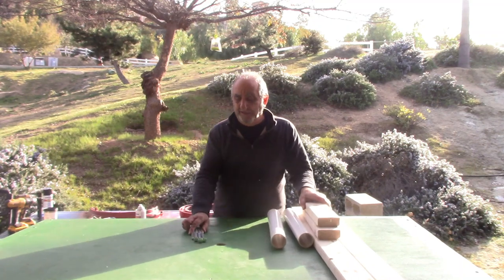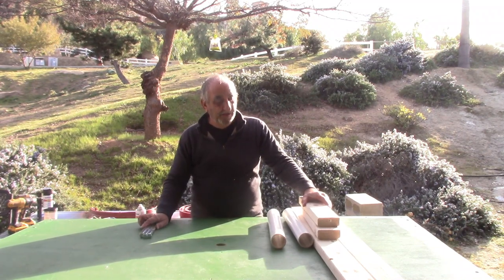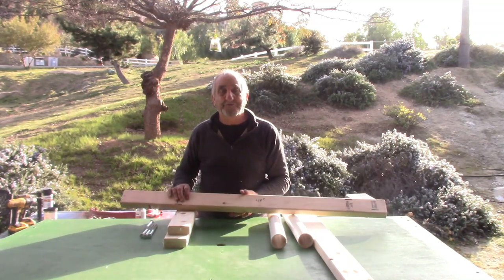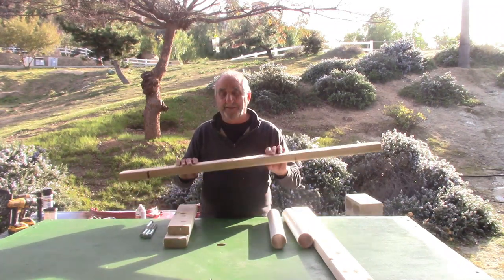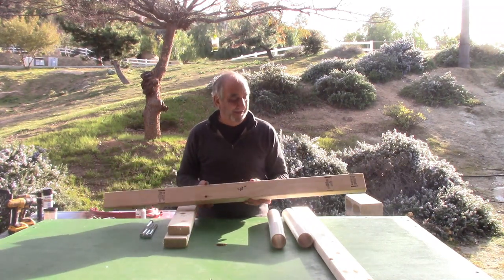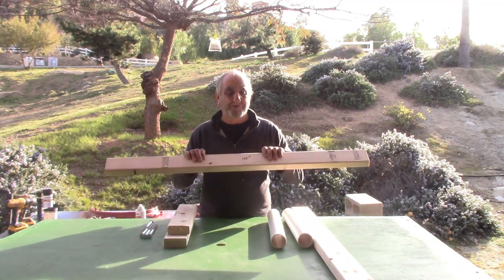But anyway, let me get to going on the mini conveyor. I call it the American Eagle mini dryer, mini conveyor dryer. The first thing you want to do, you're going to buy some things from Home Depot. First, buy two 2x4s, at least 8 foot long. Make sure they're dry, not wet. If they're dry, they'll be light. This way, after a while, they won't warp and cause you trouble later on, especially with a conveyor dryer. So make sure it's dried out.